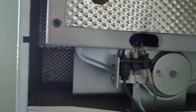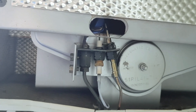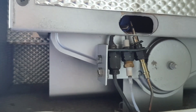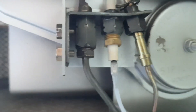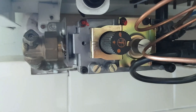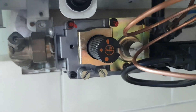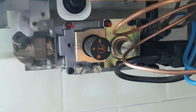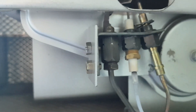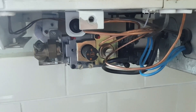I'm also going to let you listen to the pilot going off — the thermoelectric valve clicking off — because we've blown the pilot out. If you listen carefully, blow the pilot light out and you should hear a click from the gas valve. There you go — that's the thermoelectric valve springing back. Blowing out the pilot stops the small voltage travelling down the thermocouple into the back of the gas valve, de-energizing the thermoelectric valve. That's your flame failure device.